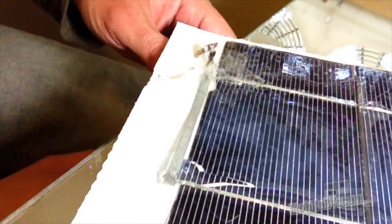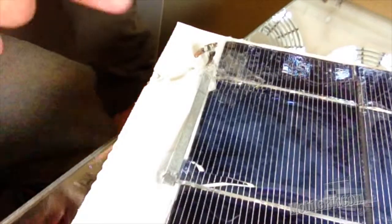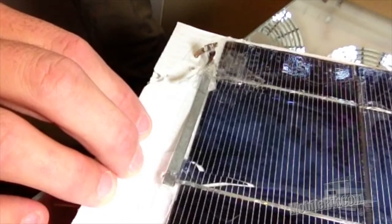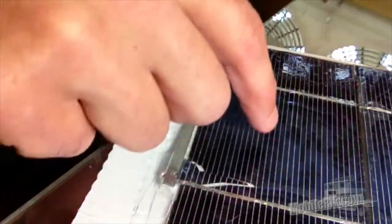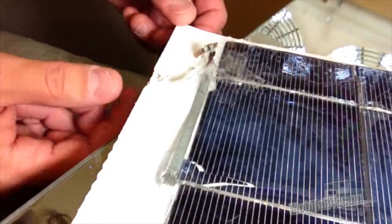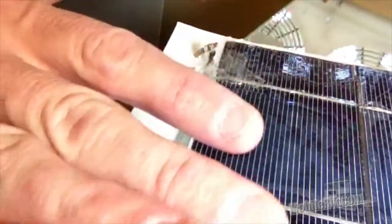That way it's a good way to keep the leaks out. We'll get part of the wood frame in the roof and connect the fat cables underneath there coming from the solar panel. With very little voltage loss and no need to run fat cables all over the roof where they could potentially come loose and shatter the solar panel — you can see these little places here where just from handling it I have shattered parts, there are fractures in parts of it, mostly in the corner. This is how I'm doing it, definitely not how everybody's doing it, but why not give it a try? I don't have to have lots of little conduit and little boxes running all over the roof, so I can still maintain a flat roof.